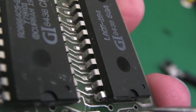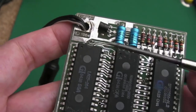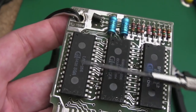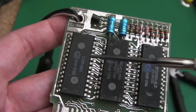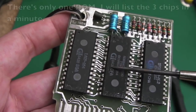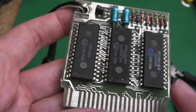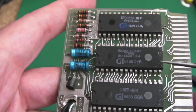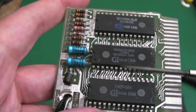The problem was the five volts was coming up here and ending here, so it was never getting to any of these chips. One of my concerns was latch-up if you get that scenario. The reason it wasn't booting is presumably because one of these ROMs sits in the boot area. I'm not sure what happens with a floating ROM when the jumpers are set so the C64 is trying to address it. I might try to work out if the pinouts are standard and attempt to dump whichever is the ROM.